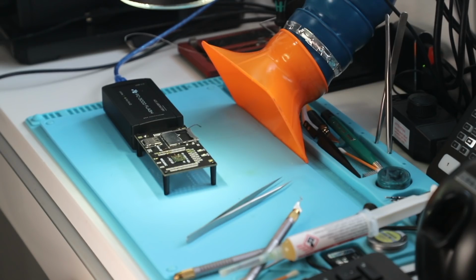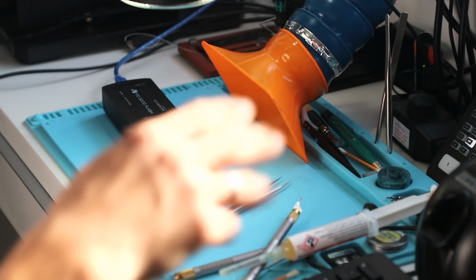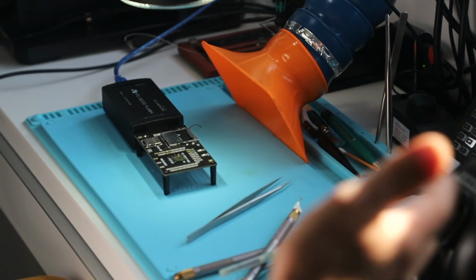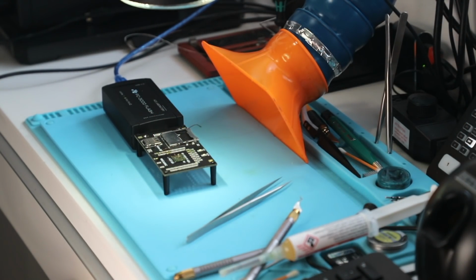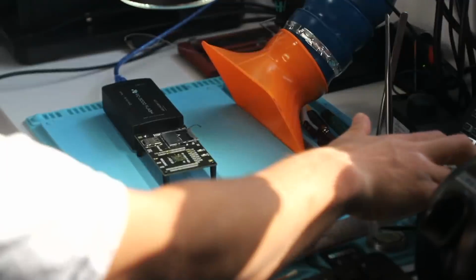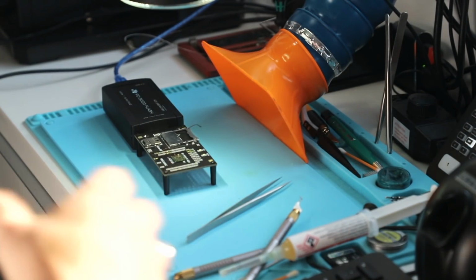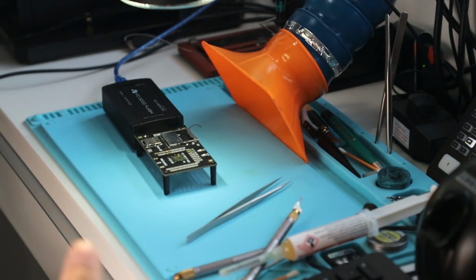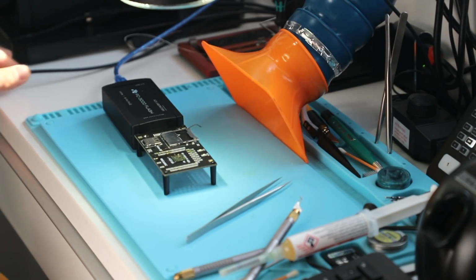But the lesson that I'm taking away from all of this is that moving forward, the device I use for recording is called the ATEM Mini Pro. It's a switchboard, located right there. It's got 4 channels for HDMI input and then 1 output, and that 1 output synchronizes with recording. Whatever I see on the screen, I record to SSD. So during the recording I can obviously switch channels, and that is very useful. I don't have to get all of these different memory cards in one place, synchronize them on a timeline, and figure out what's what. Everything is running as a stream, so it's extremely helpful in that way.